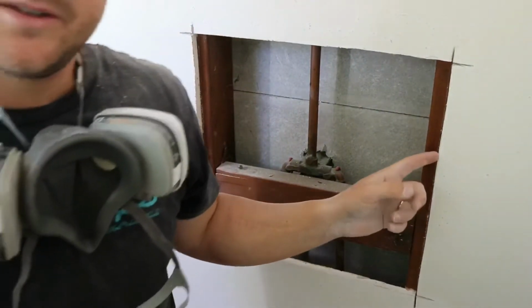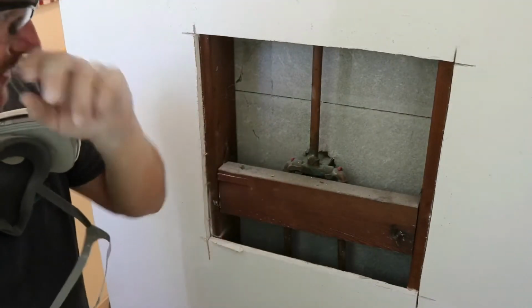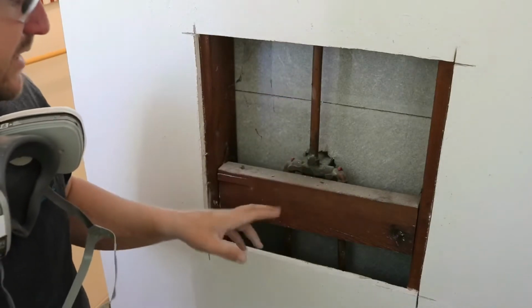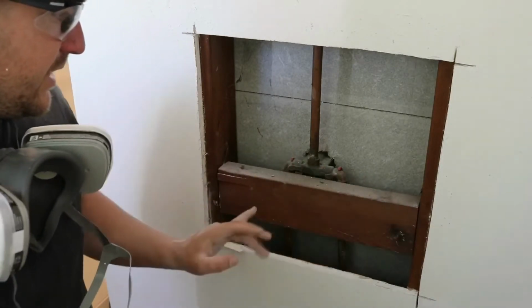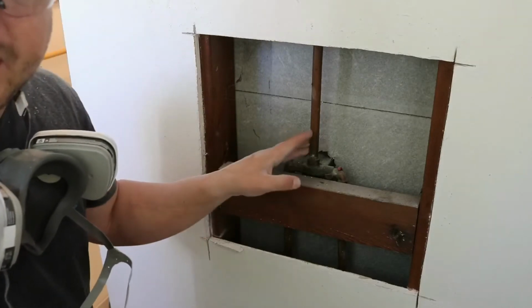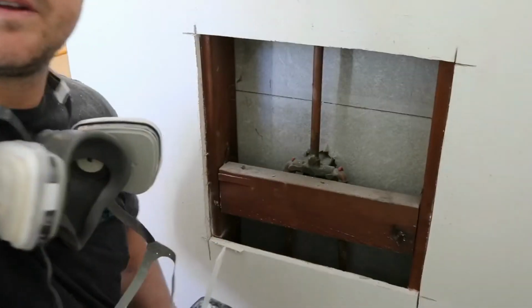It was 1/2 inch material. So basically I'm doing this in reverse. I don't want to remodel my tub or my shower enclosure yet, so I'm not breaking out the tile. I have to remove the supporting member that holds in the existing valve. So we're gonna cut this out. And then instead of cutting the pipes, I'm gonna try to just open it up by heating the pipes up, melting the solder, and removing the valve. And then we'll go from there.